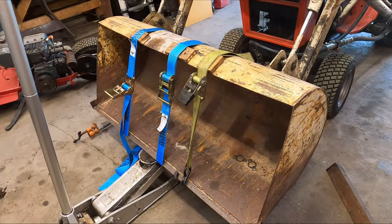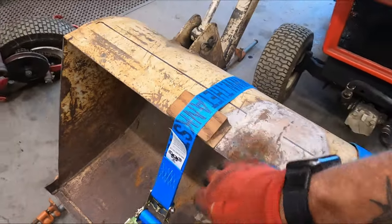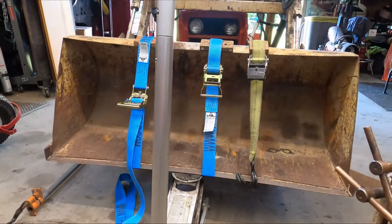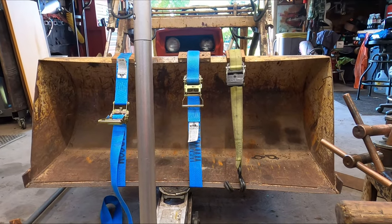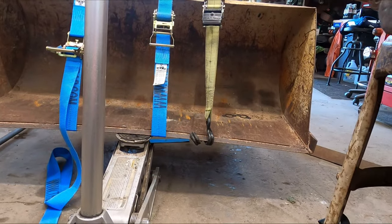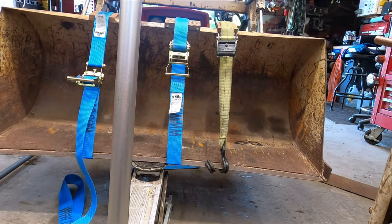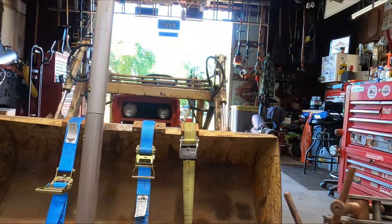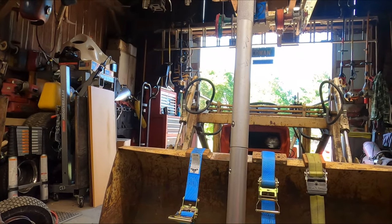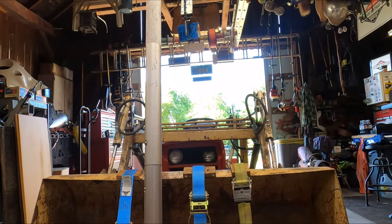With just three straps and a block of wood under each strap at each pucker, I've cinched it and pulled it down further than it needs to be. But as you can see, it's also pulling up the bottom, so that's not ideal. I think our best bet is to just get everything cleaned up and get started on our welds and draw it down as we go.